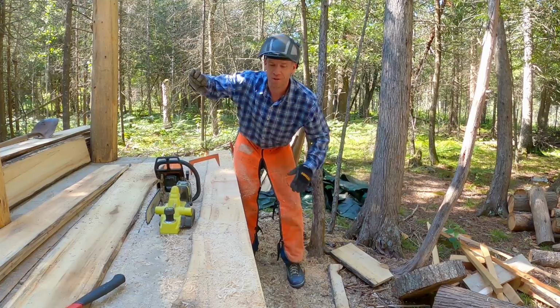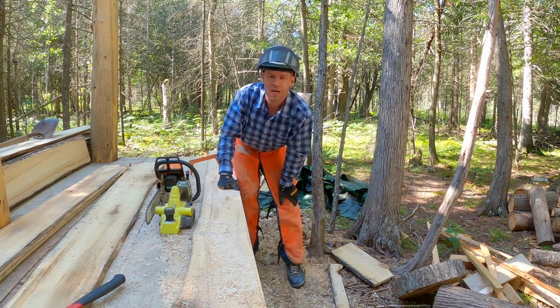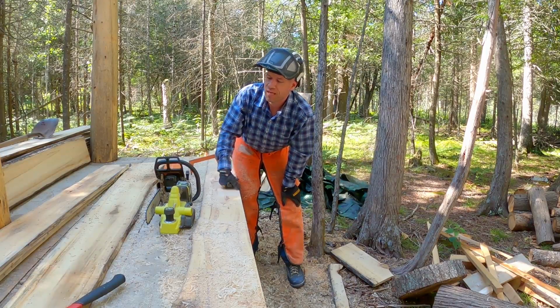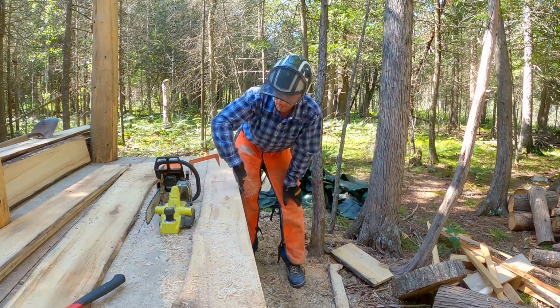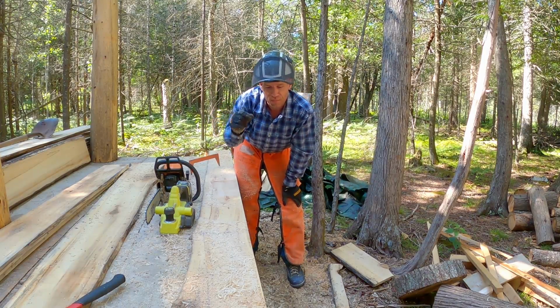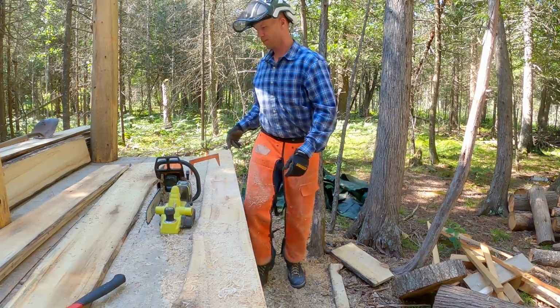It's up there in the roof and you go to put them together and there's just a little bump, a little more than you could cut off with your pocket knife or something. Have to drag them down or get the planer out or whatever. So I've just learned that anytime I rip the edges off, I run that over really fast to get the big chunks off. They always end up fitting a whole lot tighter and saving headaches in the long run.